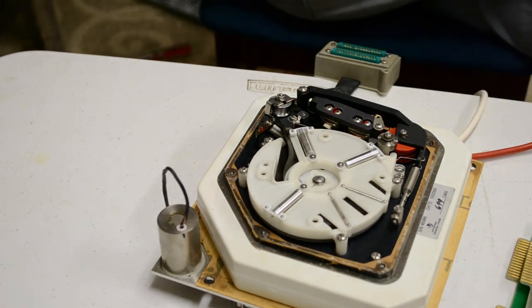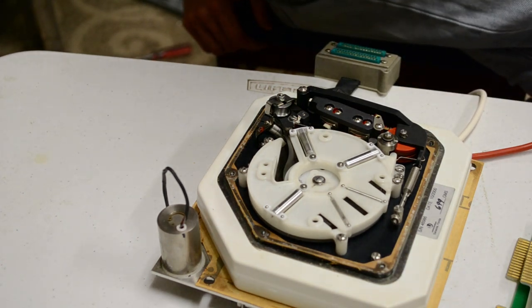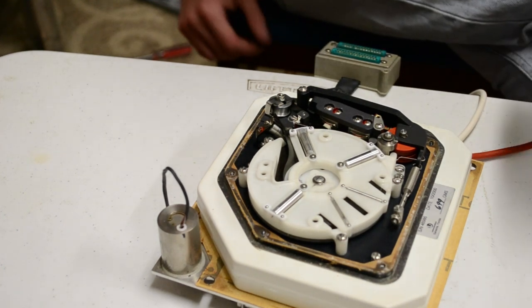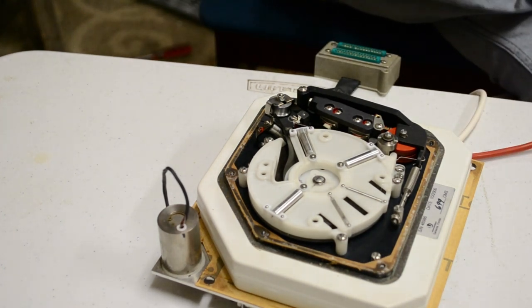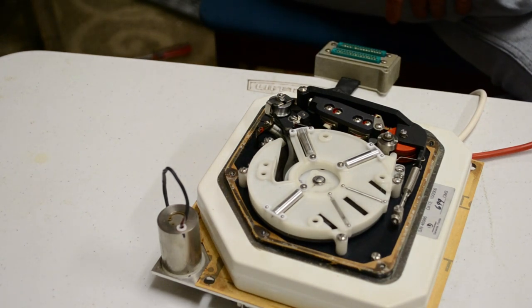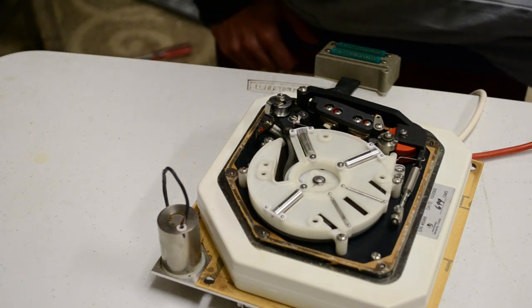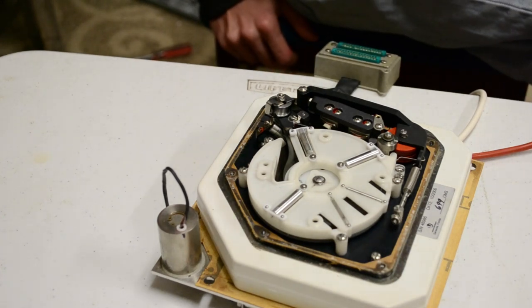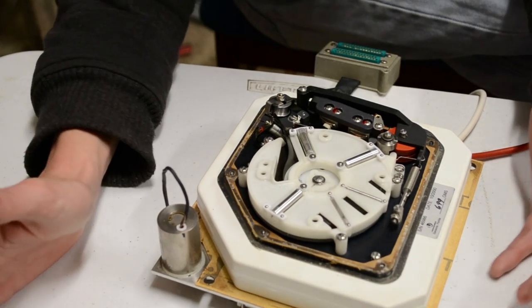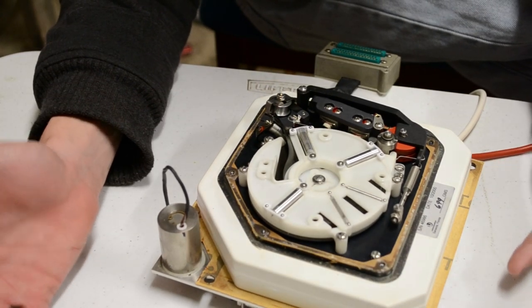Because you're trying to read quickly, you're not trying to read one track at a time. You want everything off the flight recorder. So it lets you read six times as fast. For an idea on that, I believe it's a 24-hour loop. So take 24 divided by 6. Four hours. 4 hours to read off the entire tape.